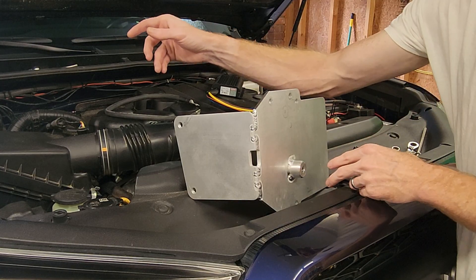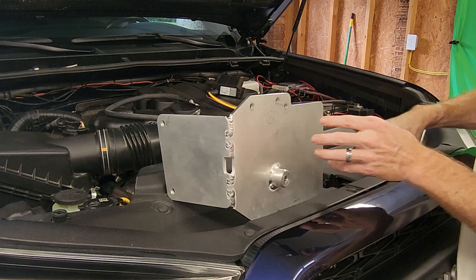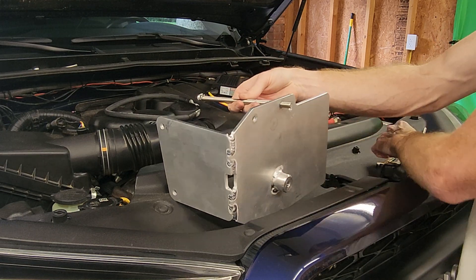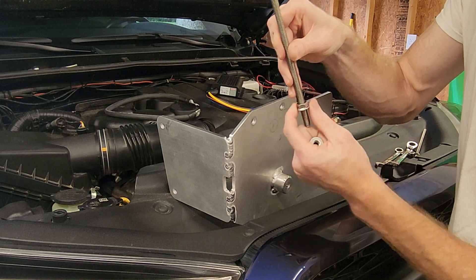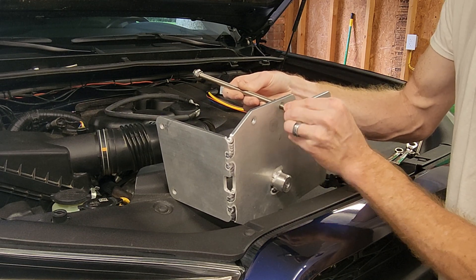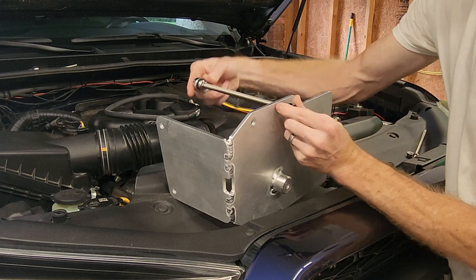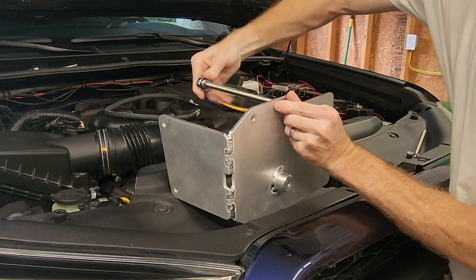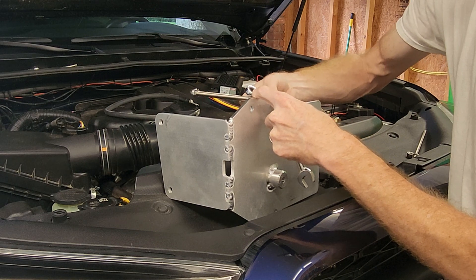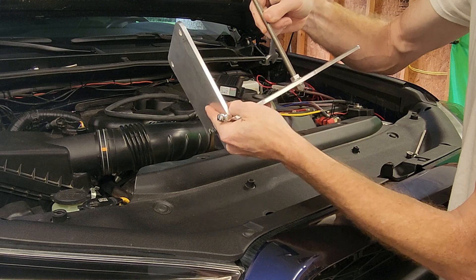Now that we've got the wiring set up and the zip ties, we need to put the rods in the tray system. The nuts are on the bottom — what we need to do is run one nut up about an inch and then it goes through here. There are four regular nuts and two locking nuts. I'm going to put the locking nut on the bottom in case it vibrates. The way to tighten it: start it up there, then put two nuts up here to jam it — they're 14s — and tighten that down. I'll run it just till a thread or two is sticking out, then run that nut down to lock it in place.